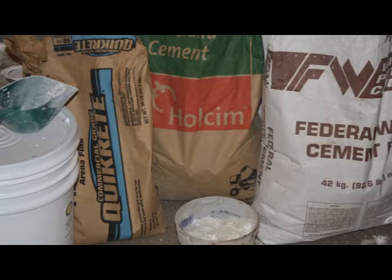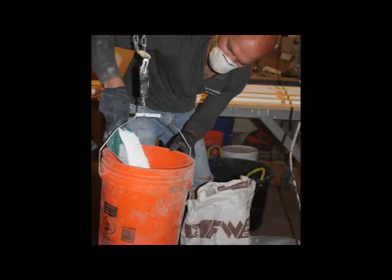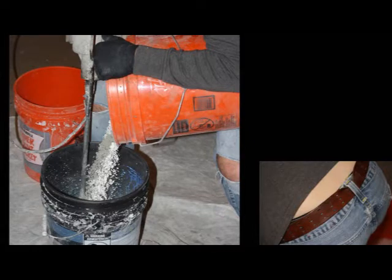It's reinforced with glass fibers, so you lose the need for the thickness of concrete that you've maybe heard of with concrete countertops. Typically in the past, they'd have to be 2 inches thick, reinforced with rebar, wire mesh, and heavy aggregate. Mine just uses lightweight fibers, and 1 inch of the glass fiber reinforced concrete is 80% stronger than 2 inches of traditional concrete, which allows you to do super thin structures, three-dimensional things, without adding a lot of weight to the pieces.